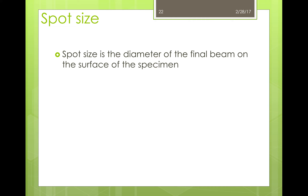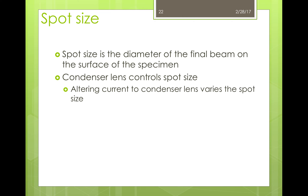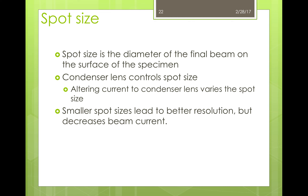One element to consider again is spot size. Spot size is the diameter of the final beam on the surface of the specimen. It is the condenser lens that controls the spot size as well as the beam convergence. By varying the current supplied to the lens, the spot size is adjusted, and it is the first condenser lens that is responsible for the spot size. When the spot size is smaller, this leads to a better resolution picture, meaning you can increase the magnification and still see the image. However, the beam current is significantly lower and restricts the field of view. The aperture and spot size work together: the aperture is the maximum size the beam can be, and if the spot size would be larger than this maximum size, the aperture cuts the beam down.